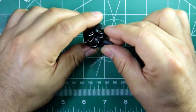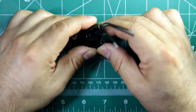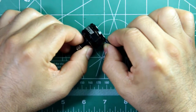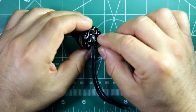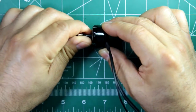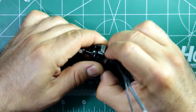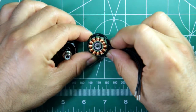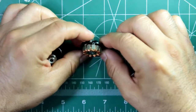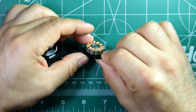It's smooth. The bearings seem to be pretty good. Tolerances are quite good. There's really no play in the motor when testing it, but of course you need to actually use it — after long-term use you find out if everything remains tight. From just feeling it, it feels like a pretty good budget motor. The finish is pretty good, and the windings are actually also quite good. They do use multi-strand wires, but they're pretty neat, and it looks like the stator is using 0.2mm laminations.